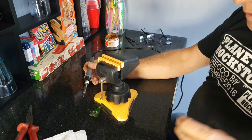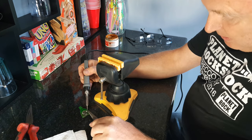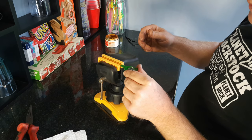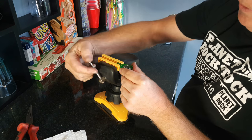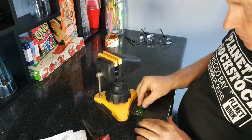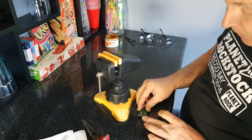I've seen videos where people have been chasing the PCB around with their soldering iron and tweezers. In particular when you're putting the replacement switch on, you'll never get it in the right place when you're doing that — very amateurish. Even just get somebody to hold it on the work surface.